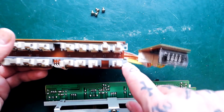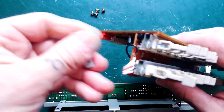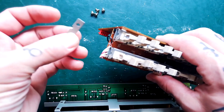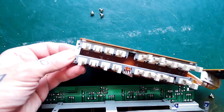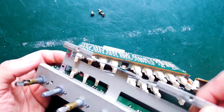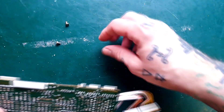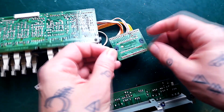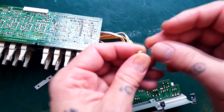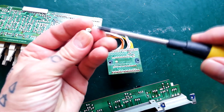Notice that on this side there are holes for the screws in the metal bracket, but on the other side there aren't — so they've used a separate little plate. When you put that back in, put this little plate behind it and that's what the screws bite into. Those are the shorter of the pink-grouped screws. The screws from underneath the meter are a little narrower in the shaft with a smaller recess for a smaller screwdriver.